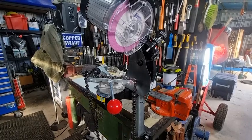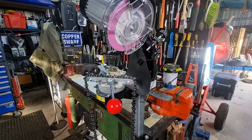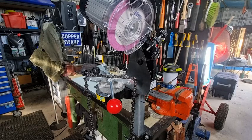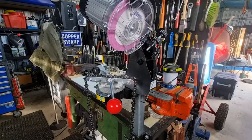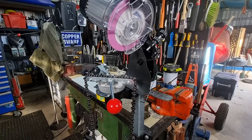Okay, so now on to the chainsaw grinder. This is where a lot of people make mistakes, and you see a lot of posts in the forums saying, 'I've got a problem — my right teeth are always longer than the left teeth. What am I doing wrong? Is it the chainsaw grinder?' Nine times out of ten, it's going to be you, the operator. Very rarely will it ever be the machine. Remember, you as the operator, as the person that sets up the backstop, determine how much is ground on the left and how much is ground on the right. So you need to be doing it uniformly.